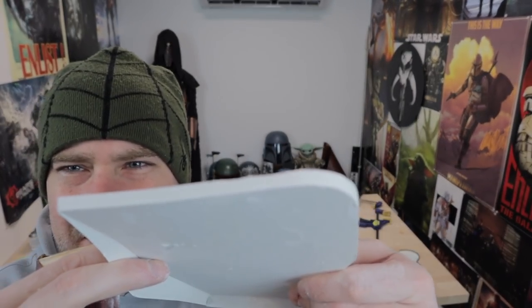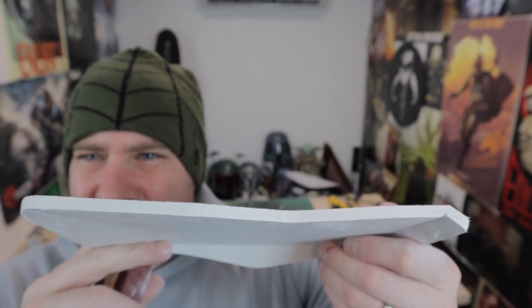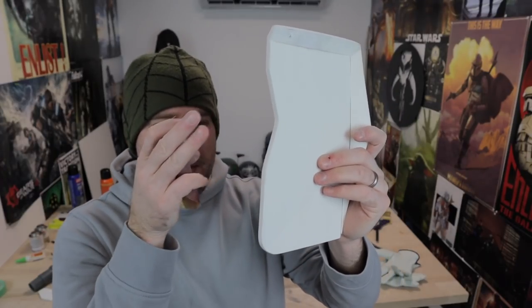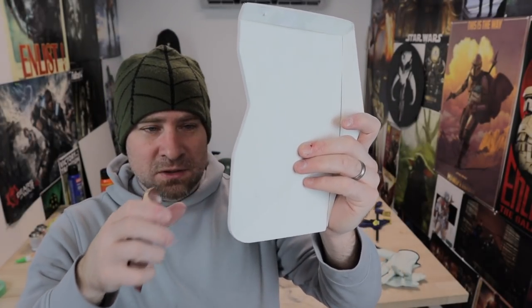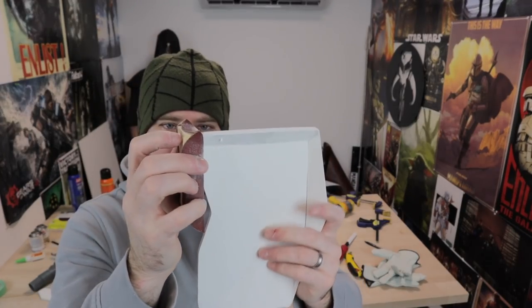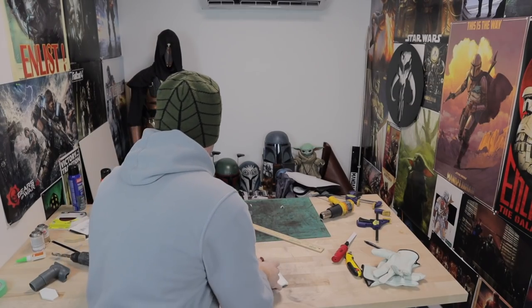Now I've got nice clean edges. You want to use a block of wood with a nice straight edge, especially for these straights, because if you're doing this by hand, this edge is going to get a little wonky, and you can really straighten it up with a nice flat block, right? I've put radiuses on all my edges. Got everything straightened out. I'll kind of show you the difference.